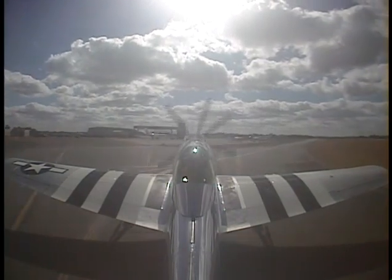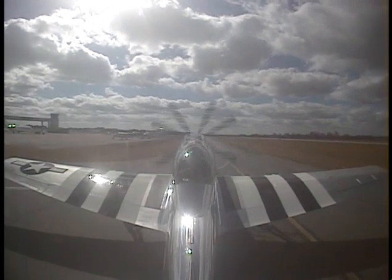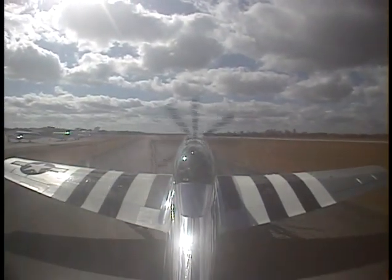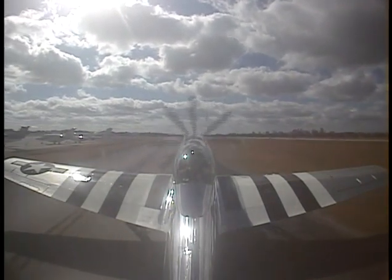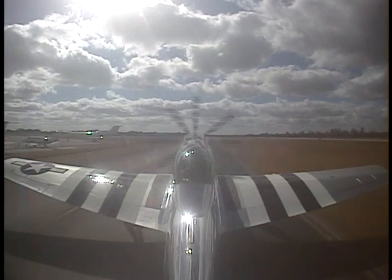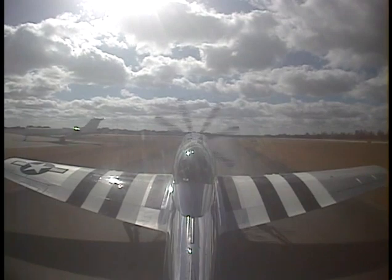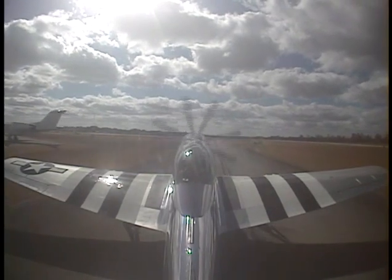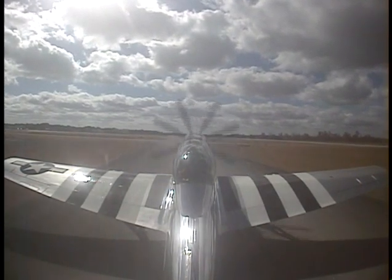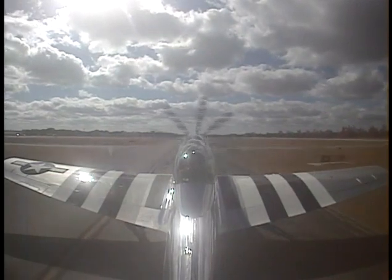Okay, it looks like it's more of a crosswind than 20 degrees up. Maybe a little bit more. Yeah, I agree with that. Mustang 6 flight cross runway 24. Mustang 6 flight 2 cross 24 now. Now, obviously I can't see forward at all, so this is why I'm S-ing back and forth. Make sure my road path is clear. Now, I might see that Pilatus, his wingtips before I run into him. But if it was just a plain old Cessna, I wouldn't know he was there until I started chewing him up. We're cleared to cross, nobody left, nobody right.